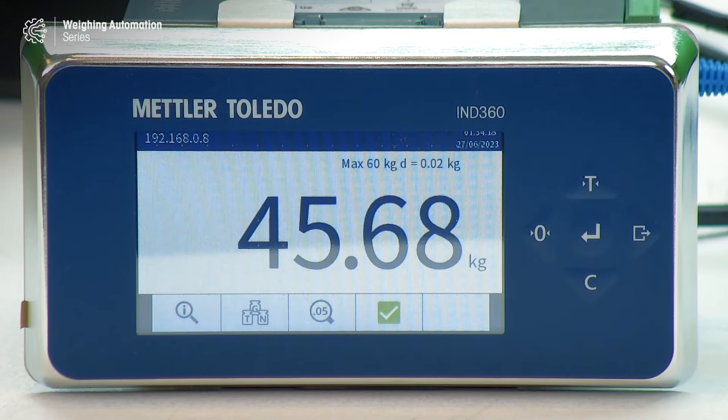Our display board is now upgraded through the front panel of the device, and our main board was upgraded through the web server. No matter which type of IND360 you have, it's always a good idea after a firmware upgrade to do a master reset of the device. If you've already set up the unit, this is a great time to take a backup of all the parameters so you can load that in after the master reset.